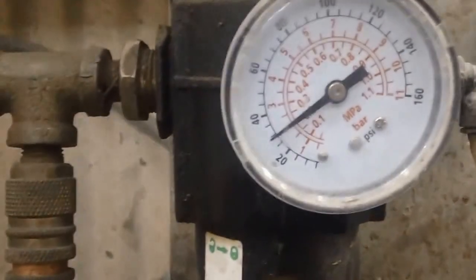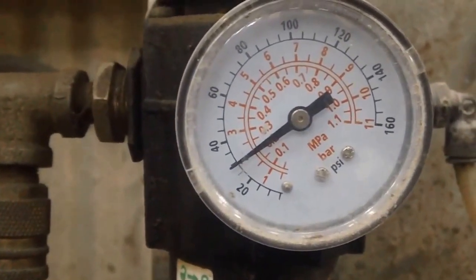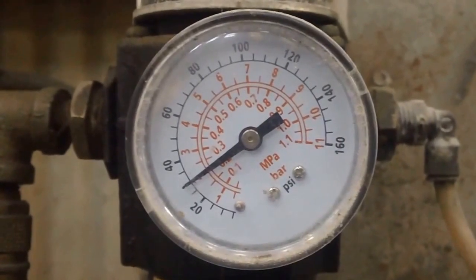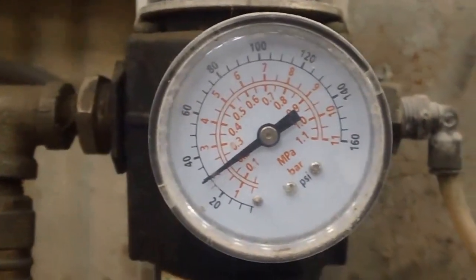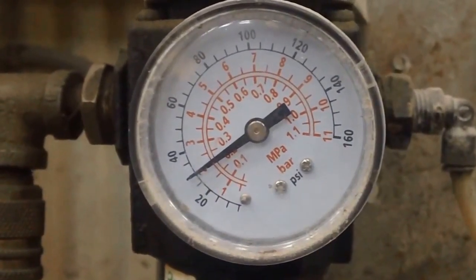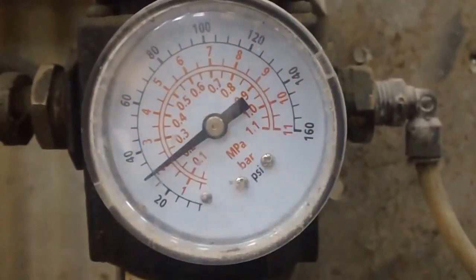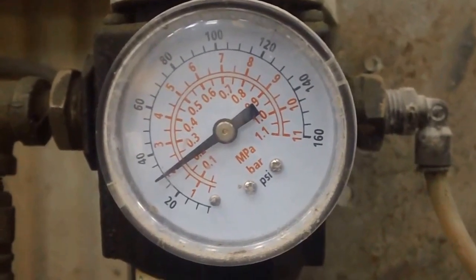We're using our CP4, so we're going to limit back pressure to 30 PSI. That way, if a larger press is needed for production, you can duplicate these results but may need to use higher back pressure to do it. This little tiny screw press tends to get things drier at lower pressures than larger presses would. So if we were to run this at 100 PSI, the result we get might not be repeatable with a larger press.